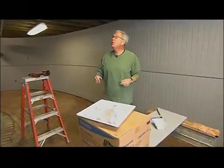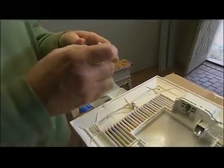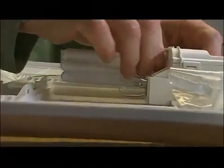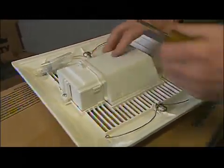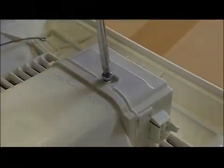Typically you would take care of all your hookups, put your drywall up, and then install the grill, but because we aren't putting anything up on the ceiling, we'll move right onto the grill. The grill itself has a couple of lights as opposed to lights in the housing — one is a compact fluorescent that slides in, and then there's a nightlight. With those in place, the cover goes back on. A compact fluorescent is very energy efficient and will last a long time.